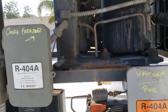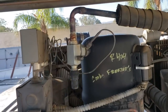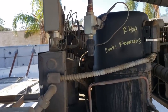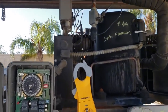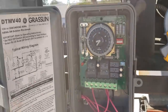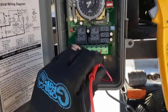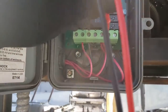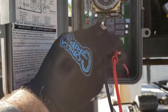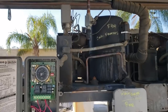We've got some Cook's freezers that aren't working properly. This is it right here — condensing unit's not running. So the first thing we're going to do is start checking voltage. We'll go to the time clock. There's a breaker panel over here, but I'll just check right here because this should have power at all times. And I've got nothing — that's on L1 and N. So I've got no voltage, so we're going to open up the breaker panel and check out there.